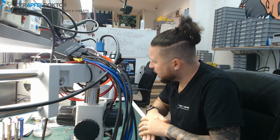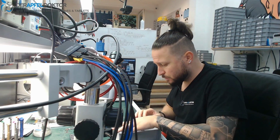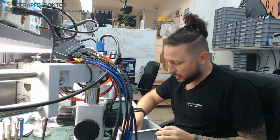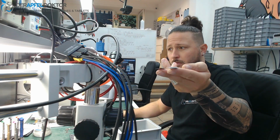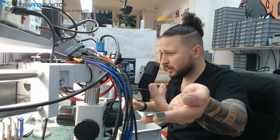We do not do a repair. I just have to do an iPhone 6s board swap for data rescue after a massive saltwater damage. I already prepared the CPU and RAM and the NAND. See it here, it's already separated and ready prepared.